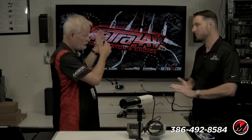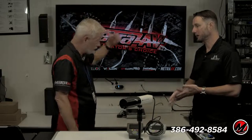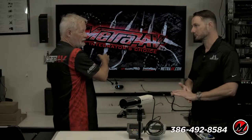Now, let's talk about some of those specs for a second. Sure. A lot of people don't understand HDR. That's not a bandwidth spec, that's a metadata spec. Correct. So all the work's done in the panel. Right. So if I have content, a movie streaming in that, say, we pick 10,000 nits. It's capable of 10,000 nits on the content. And you mean the content, absolutely.